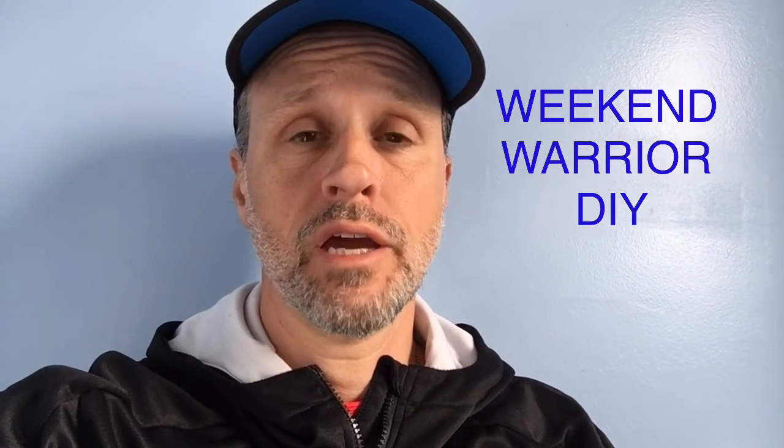Thanks for watching the first episode of Weekend Warrior DIY. Basically you just need to switch off the circuit breaker, figure out how things come out — in my case it was two fans, the heater needed to be moved out of the way before I could get the other fan out. Three screws in one, three screws in another, remove the housing, then brush out as much dust as possible. I needed to use a damp brush since it hadn't been cleaned in nine or ten years. Put it all back in — everything fit back fine, and you can definitely tell the difference between a clean fan motor and one with eight years of dust buildup. I'm not an expert by any stretch, but I've owned homes for nearly 30 years, so hopefully I can provide a little more guidance on some other issues in the near future. Thanks for watching.